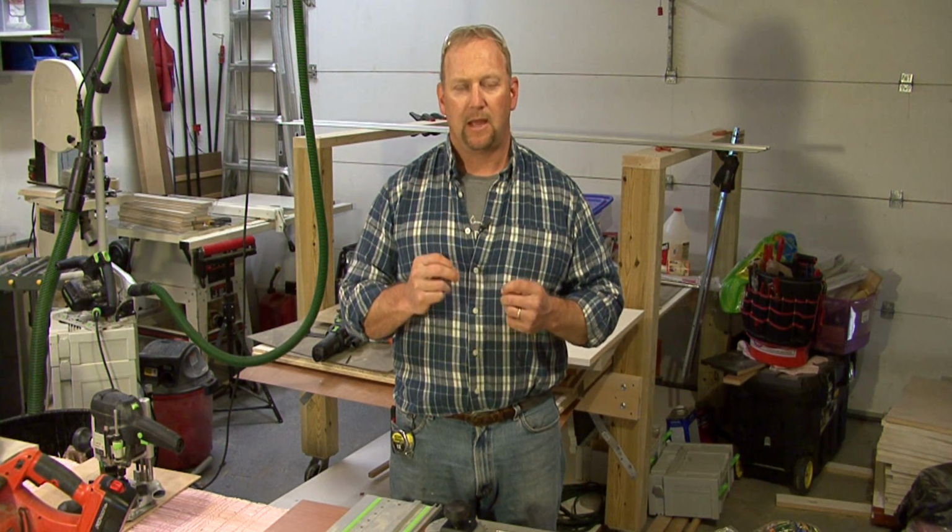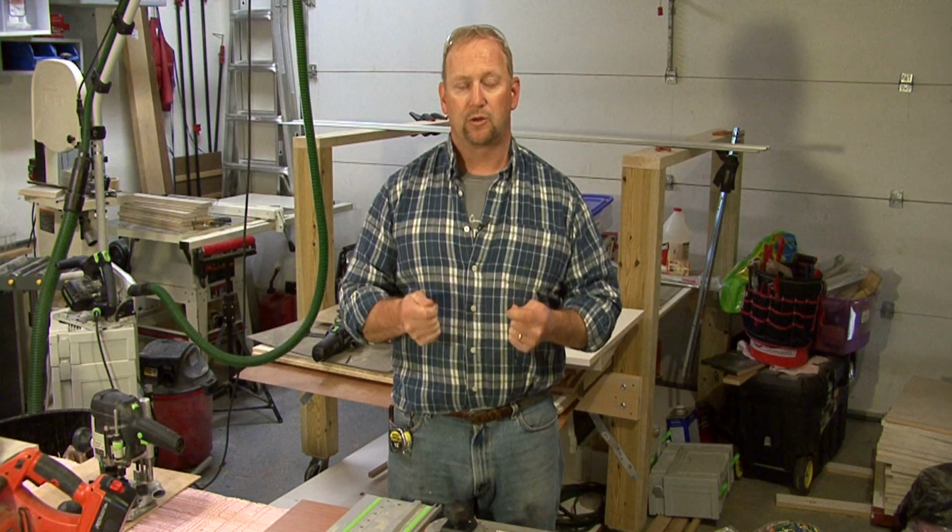So the demands for electricity are much greater, but also more consistent. Older homes with the type of wiring that they have and the type of amperage that's brought into the house tends to fluctuate quite a bit, and modern electronics does not like to have electricity that fluctuates. It can actually harm those devices. So if you are running modern electronics in an older home, you always want to make sure that you use some kind of a line conditioner or surge protector or a power backup system that has surge suppression built into it, or a line conditioner, so that it evens out that electrical load.